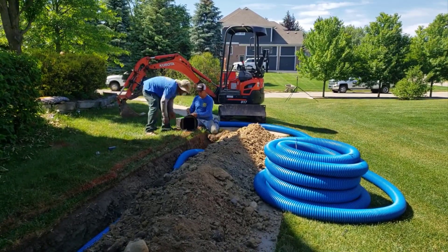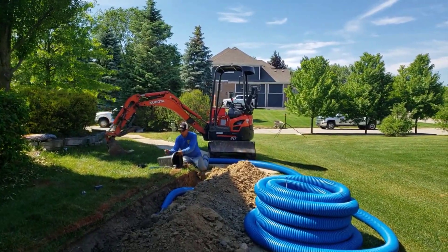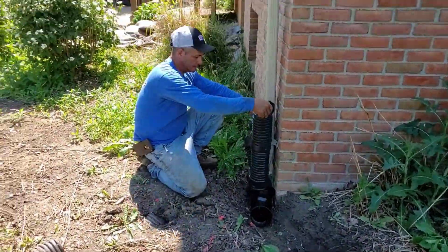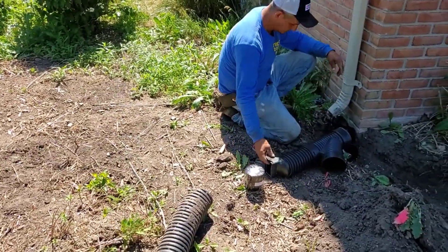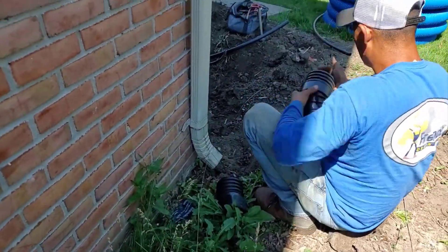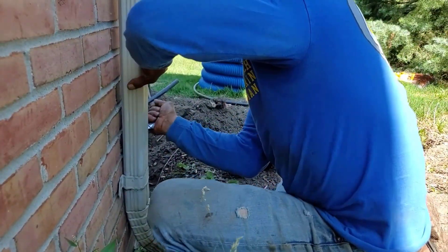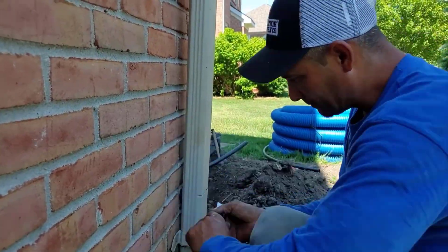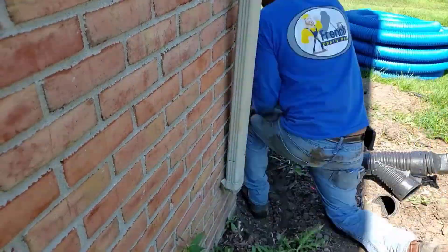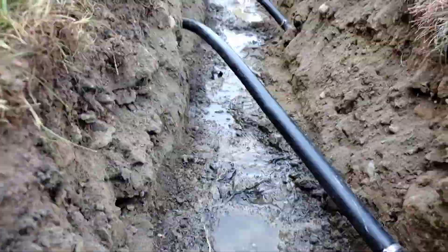We're teaching you how to do a complete roof runoff system. This is where you start. You might take care of your drainage problem right here if you're just managing and directing your roof runoff properly and responsibly. You might be shocked — your yard might not need a French drain. In many cases I've told homeowners a roof runoff system is all you need. I've seen it thousands of times. This job was done two months ago, we've had some serious rain events, and the homeowner has reported back happy. We fixed the problem just by running the downspouts responsibly far away.